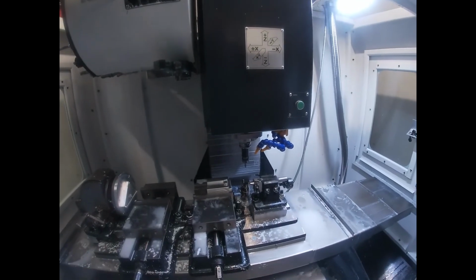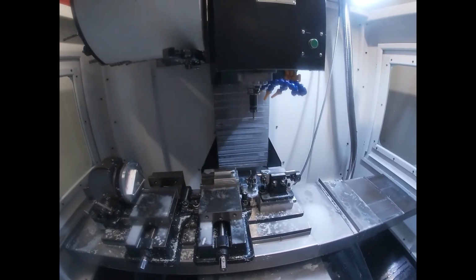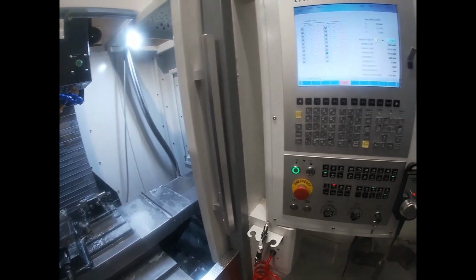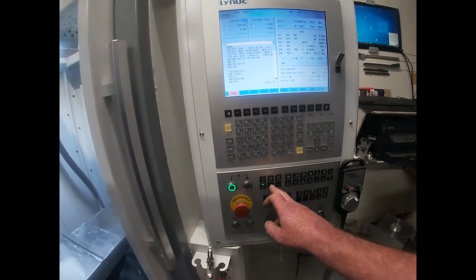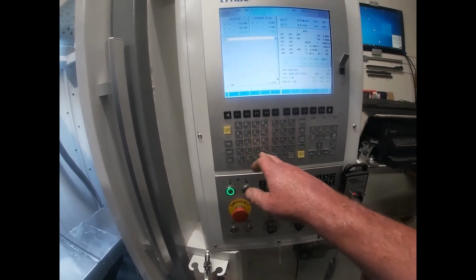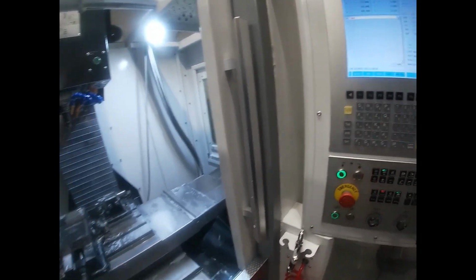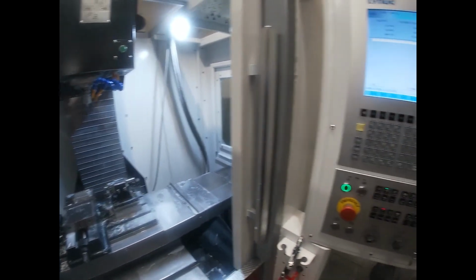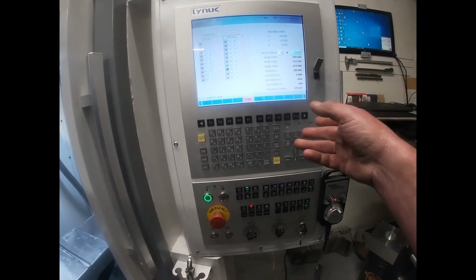You've got to make sure the top of it's really clean, because it's really sensitive to any dirt. It'll try 5, 6 times if it can't get it. See, that was 3, 4 times, but it will go to 6 before it times out. So now that tool is set. If we want to do another tool, let's go back to program, and let's go to MDI. We'll just go tool 3. So tool 3 M06, and then it's cycle start, and there she is. Really easy. Then it's the same thing if you want to do the tool set. You set tool 3, 12mm, and then start.